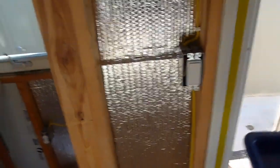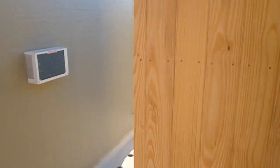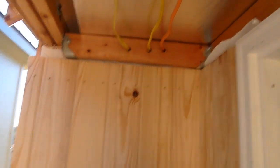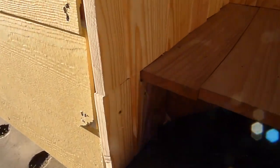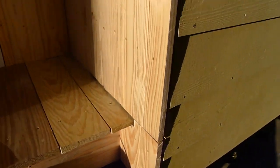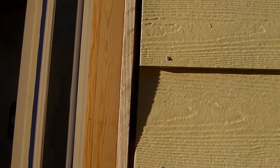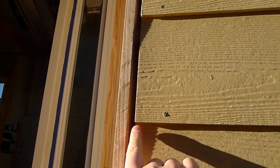Let's take a look at something else that's pretty exciting that I just finished. When we walk out onto the porch you'll notice it actually looks like a porch because I finished siding the thing. I didn't side the roof area but I did side all of this, and I even jumped down and did the area underneath this decking which involved some 45-degree angle cuts and a couple of retries to get it right. I got this side too, and it's really nice that this came out — I measured it so that the thickness, how far this comes out, is just at the peak of how far out each piece of siding goes.